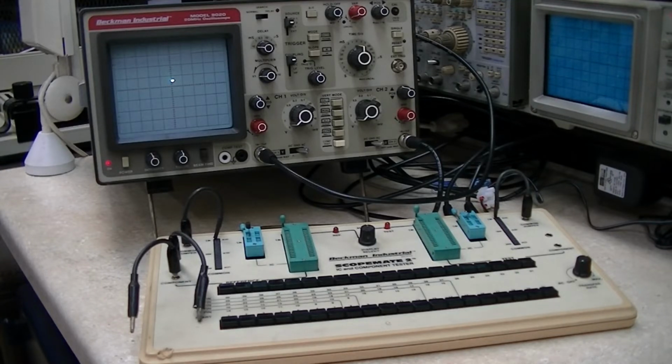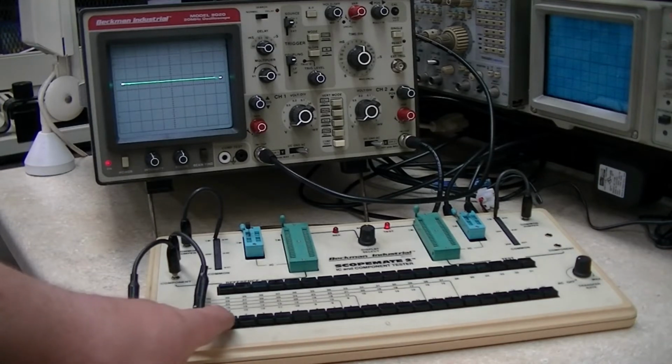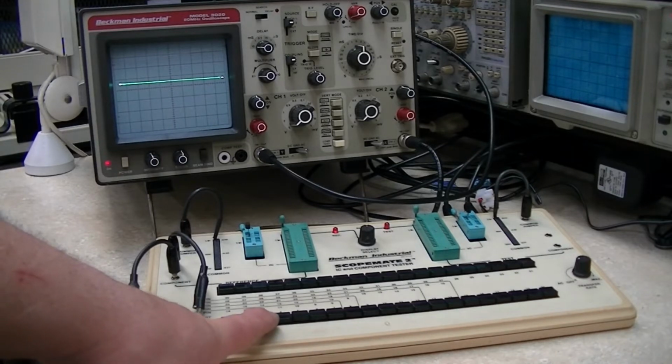I've got a couple 2SA950 small signal transistors in here in socket 1 and socket 2, and we'll start off some of the comparison testing with it. Turn this on, and obviously pin number 1 is going to be dead short because that's what you're referring to, and then pin number 2, and you can see it flashing back and forth between both sides. Now for some reason there seems to be a difference between each side regardless if there's a component in there or not. That's why it expands and contracts a little bit. I'll have to do a little research on why that is. Maybe the little relay in there is getting bad.